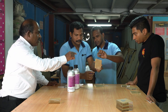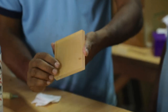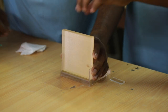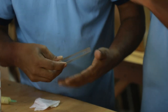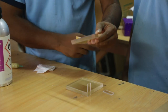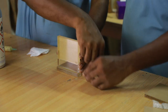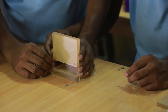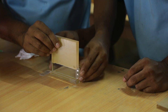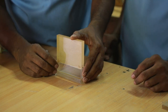With 192, we give a 2 mm bevel on the edge to create a gap to fill with the Acryfix. Only in this gap will the Acryfix go, and it will hold the bottom and the top together. We are not putting the Acryfix over the whole area like with the previous method 127 — this time we are allowing only the 2 mm area. This way there are no chances for bubbles. Before applying the Acryfix, we hold the top and bottom with a small thinner acrylic using chloroform paste — it acts like a jig.